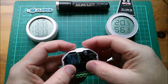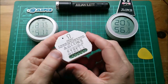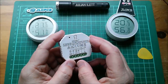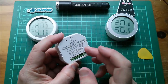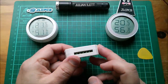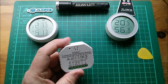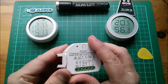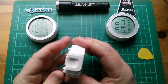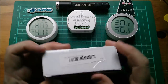Let's put this back in its box - it is a very tight fit, but quite nicely made. You could also sit this in the back of a mains outlet, but the danger is UK sockets are 13 amps and this is only rated at 10 amps - you should probably de-rate it to about 5 amps. It does have this bracket that looks like it's DIN-rail sized, so it could potentially sit on a DIN rail inside a consumer unit.